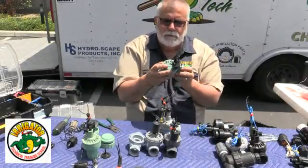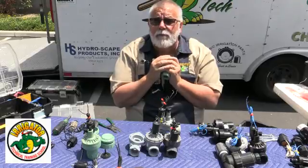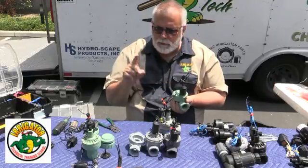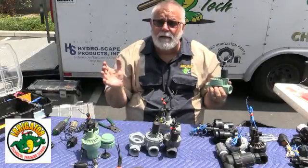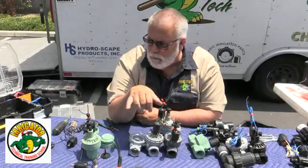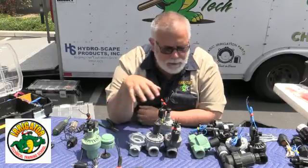If you've got a Water Master — the little green Water Master valve — there are a lot of those out there. Even the Rain Jet. So if you've got a Rain Jet valve that's an anti-siphon valve, the same solenoid that's on a Water Master, Orbit, Hydro Rain, and Irritrol is all interchangeable. If you make a note, you can use the Hydro Rain, Orbit, Irritrol, HIT, and Champion — all of those solenoids are interchangeable.